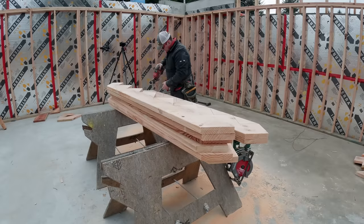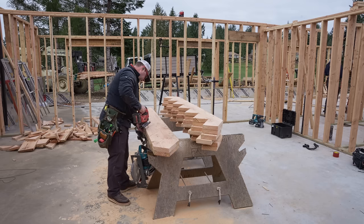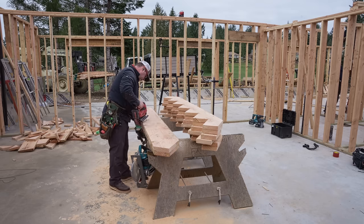You've got to make sure that you get the right shank blade for jigsaws, and I'm pretty sure I did not. So thankfully I was smart enough to not assume I had blades. Anyway, bought the blade. It does vibrate quite a bit, you notice. I should have put it in orbital action, and it would cut even a little bit faster.